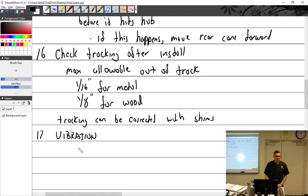So it's really important when you take apart an engine, cowling, or say the spinners, anything, that you mark it with some tape or something and index it. Say, this absolutely went this way. Because if you don't, the prop ends up going 180 out, then the spinner is 180 out or back the way it was, and it's a mess. And now you've induced this vibration, and you have to try and figure out how to get it out, and then the owner's mad at you, or it's your plane, you're mad at yourself for making the whole plane shake.